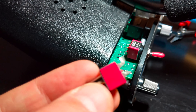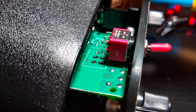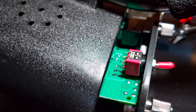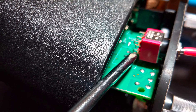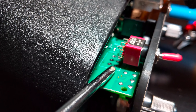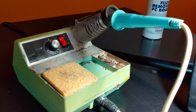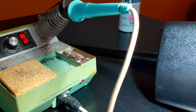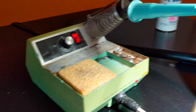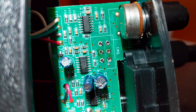With the old switch out of the way and the new switch in place and mounted, I tested it to make sure it works — the physical size is the same so everything's good. The plan is to drop some wire connections — there are six of them total — from the switch down to the PCB and solder those six points. For soldering I'm using a very old Weller workstation that I actually picked out of the trash and repaired many years ago. It's been reliable and it's a great iron. I'm using a bigger tip and we've got SW1 right there.